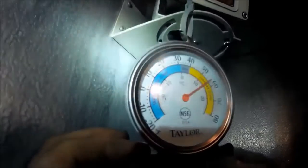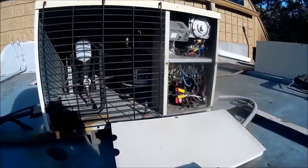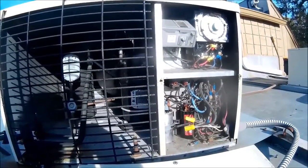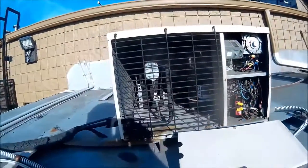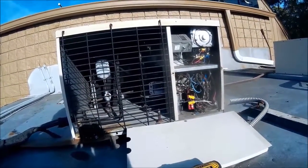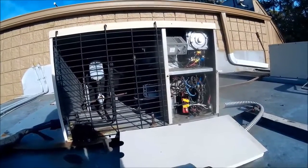We finally got it up and running. Let's go back outside for a second — it's roughly about 55 degrees in there right now. Let's give it a few minutes and see what it does. We finally got the unit up and running, we got a nice sight glass — that's nice and full. Finally got everything figured out on this. It's just so irritating when you think you got something done, and then at 4:30, right before the supply house closes, you gotta run over there and grab another part.